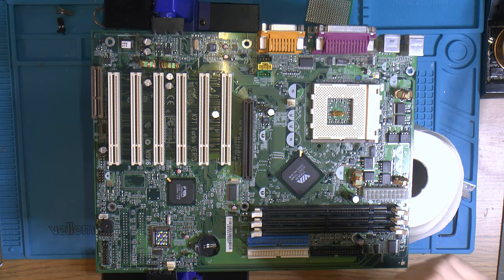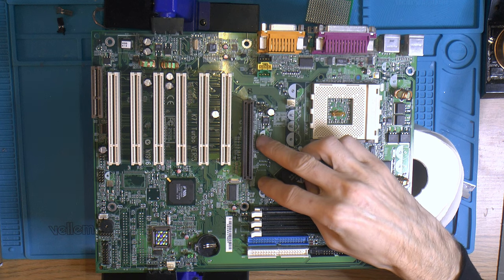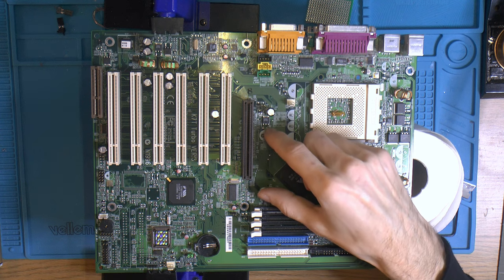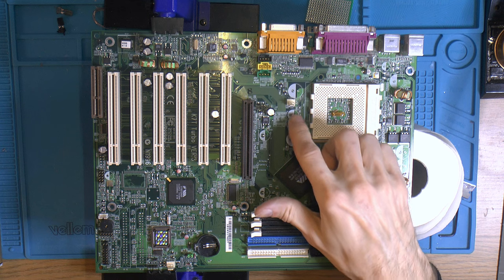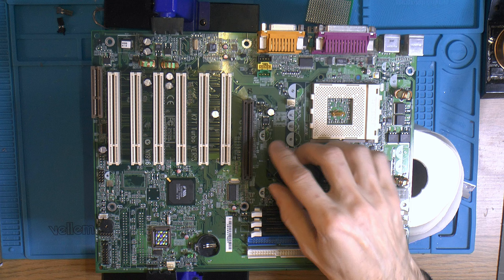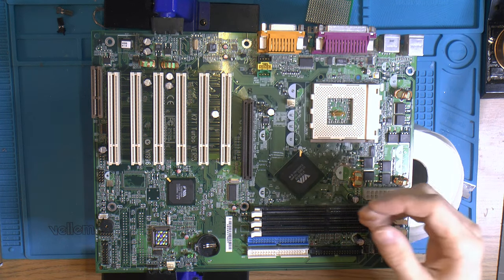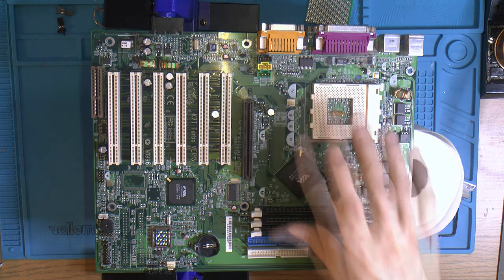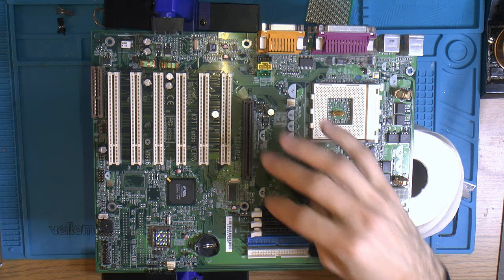I think next up would be those two caps here. They are rated at 2700 microfarads originally. I bought those because I needed them for the build of the power supply tank. And since these are 2200 rated over here, if you want to install those, I actually bought like 10 of the 2700 instead because it's cheaper. You get a rebate when you hit 10 most of the time. So I'm going to upgrade these from 2200 to 2700, so these two here will be the same as these two here.